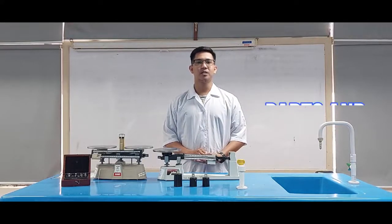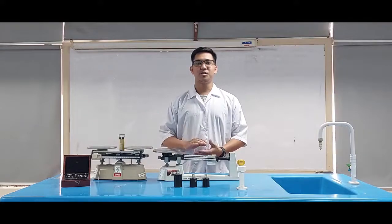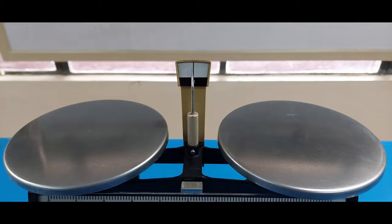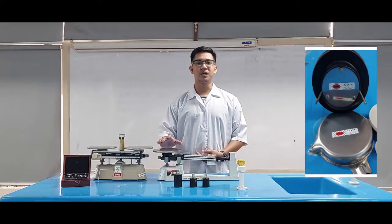The following are the different parts common to the four types of mechanical balances. The pan: this is where watch glasses or other suitable vessels are placed to receive the substance to be weighed and the weights. There are two pans in single and double beam balances, while triple and four beam balances have only a single pan.